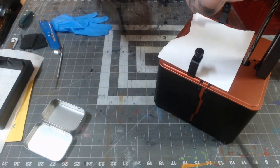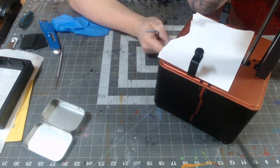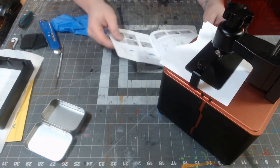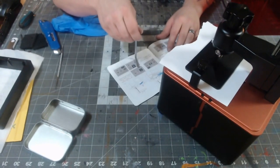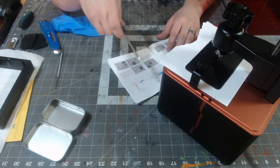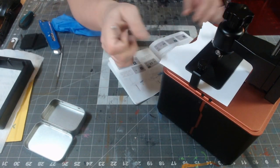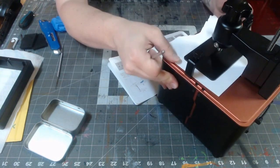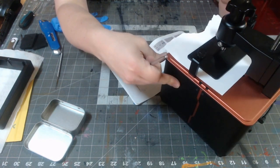Okay, so now we'll go ahead and level it. Loosen these screws. Go ahead and send it all the way down. Just because I can be a bit of a dum-dum sometimes, I'm checking the manual here. It says to hold it down and fasten screw number one, that's the front, and then screw number two. First, though, let me just try and get a peek here, make sure that this is actually straight on the machine, not twisted, because it will twist as well.